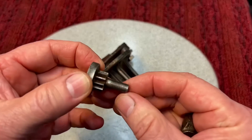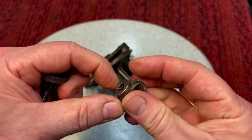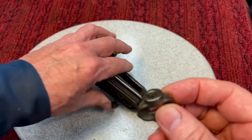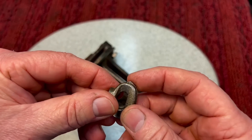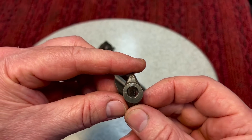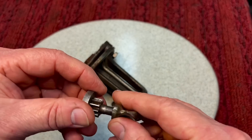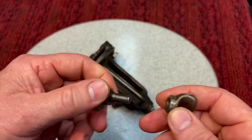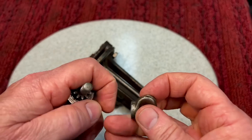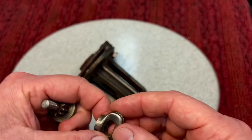The problem is that this is stripped — he can't tighten it, and this has to be real tight or else when you're using it, it'll open up. Here's the part that's broken: you have the thumb nut adjusting, but it's got a little spur gear and knurling. Those threads are flattened out. Also, whoever tapped or drilled it, it wasn't centered. So what we have to do is fix this so it clamps down. Obviously making this part is out of the question with my skill set, so we're going to see if we can fix these threads and make some kind of thumb nut to put this back in service.